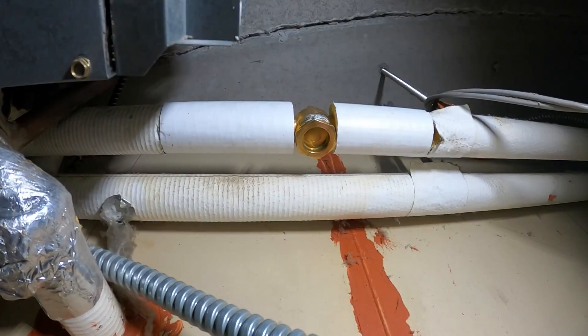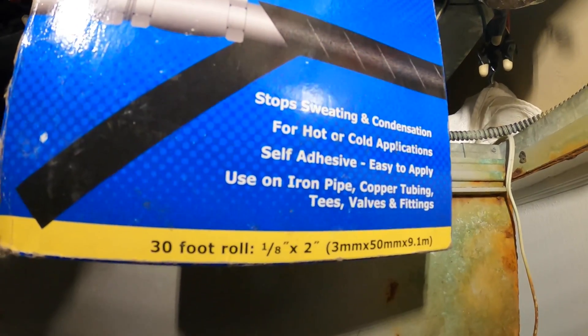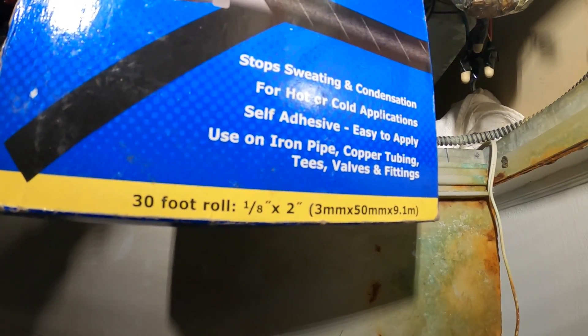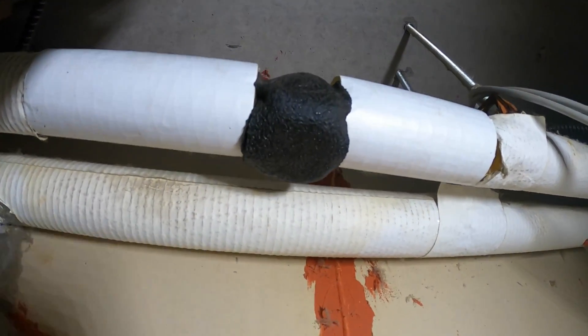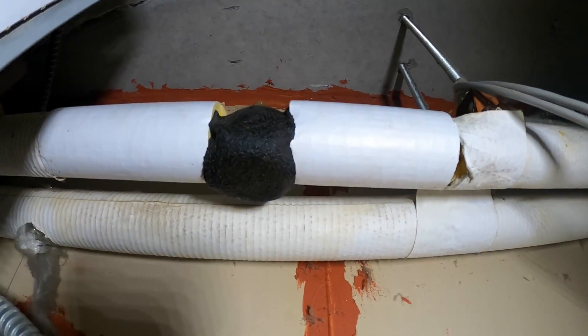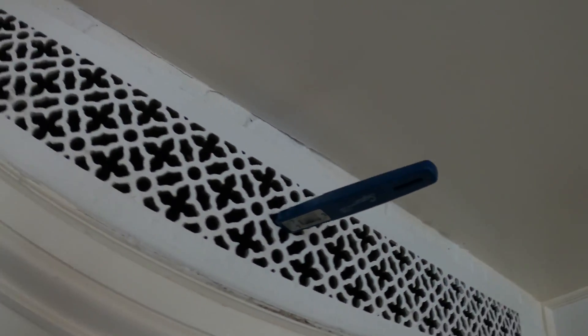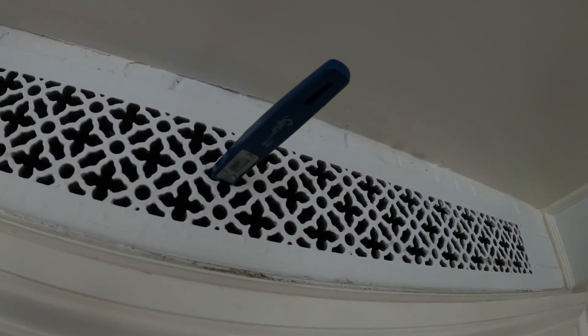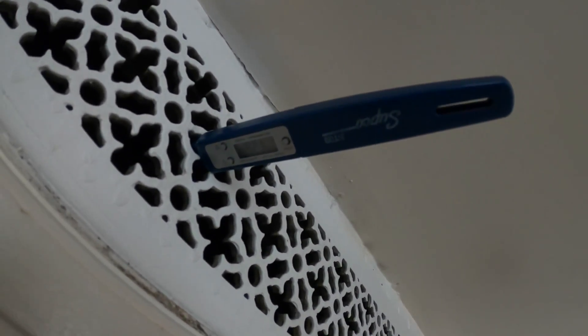Let's go ahead and insulate this pipe. I put two pieces of fiberglass insulation. For the valve, we're going to use cork tape — it says 'stop sweating and condensation for hot or cold applications, self-adhesive, easy to apply, for copper tubing, tees, valves, and fittings.' So I'm going to wrap that around the bottom of the valve and tape everything up to make it look nice. I left the top a bit free because we need to get the actuator on there. We got 92.1 degrees — that's pretty much what these units put out as far as electric heat. This one's doing pretty good. Some of them, honestly, all you can get is about 85 degrees, and somehow they undersized these things, and some of the valves are leaking by. But this one's doing pretty good — I call it a success.